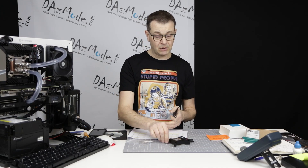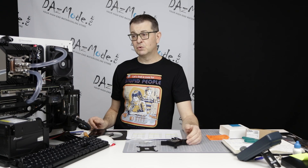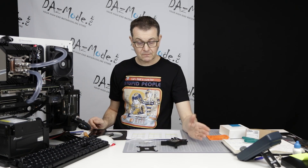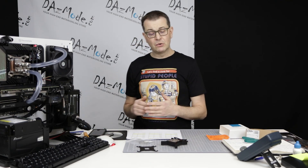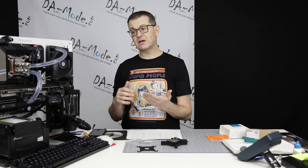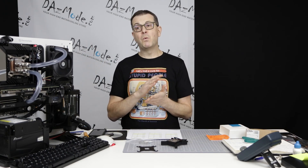I mounted the block on the system and started getting really horrible results — not even close to the original Velocity results we had in episode one. I tried mounting multiple times, but it didn't work. Every time I noticed the spreading of the thermal paste, comparing with the results I was getting with Velocity 2 and Heatkiller 4, which were blocks formally certified to use with this platform, was not as good.